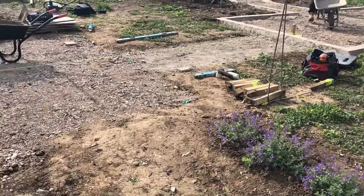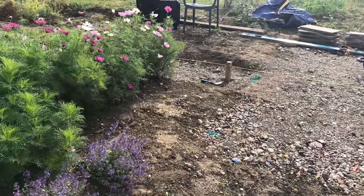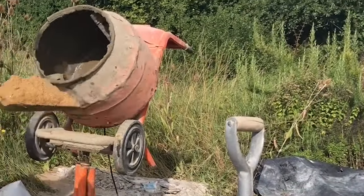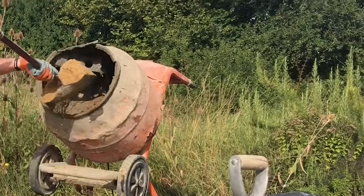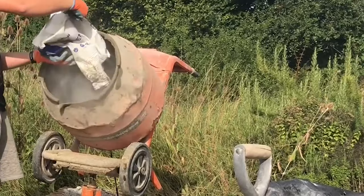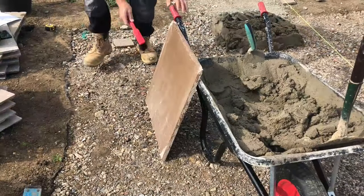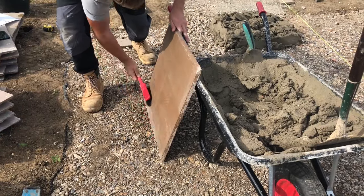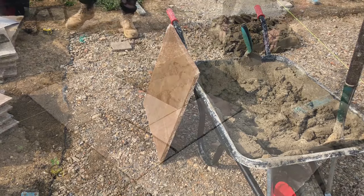Every project site is different, and a judgment will have to be made at the start of the project as to the long-term stability of the existing ground. Using a small mixer, put a half bucket of clean water into an empty drum, add 4 to 5 shovelfuls of coarse sand and 1 shovelful of cement. It can be beneficial to wash down the back of each paving stone in order to help with the laying process.